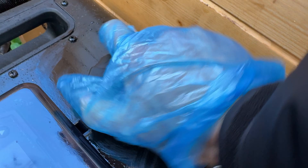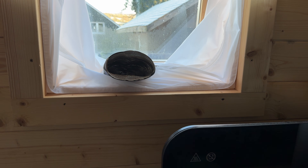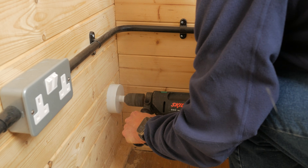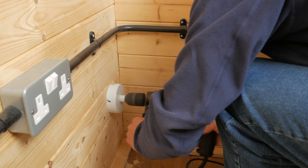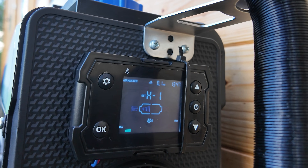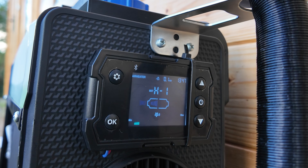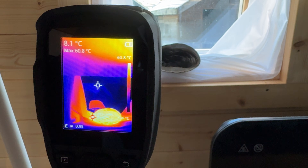They're super simple to use — fill the tank with diesel and connect power. For my initial setup I just ran the hot air ducting through a window using the same vent kit I installed for my portable air conditioner; this log cabin also gets unbearably hot in the summer. The second unit I permanently installed, drilling a 95mm hole into my cabin wall to install the hot air ducting. On both my test units you simply press and hold the power button for two seconds to start them up. The startup sequence takes a few minutes while the glow plug heats up, the impeller draws in air for combustion and the fuel pump starts delivering diesel into the chamber. Once it's running you get a steady stream of warm air into your space.